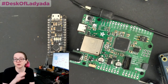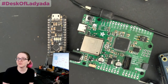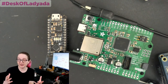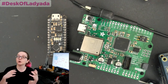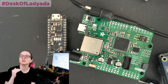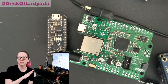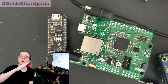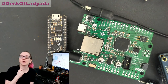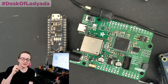A 10 microfarad ceramic capacitor costs maybe 10 cents, but for that same price you can get a 200 or 470 microfarad electrolytic. Second, if you need a lot of capacitance because you have a big power supply with high or inconsistent current draw, ceramics top out around 100 microfarad, and they become expensive and less effective at higher values. Ceramic capacitors are also highly affected by the DC voltage across them.